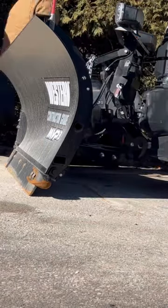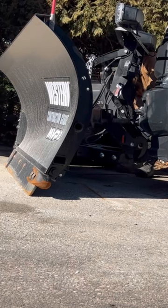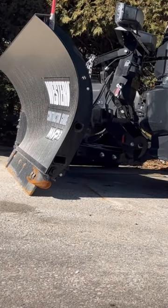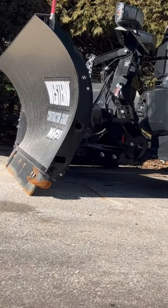Here I am just hooking the hooks up right now. Hooking the plugs up — there's two plugs. Give yourself some room when you drop the plow, and also when it's off it's a good time to grease it.